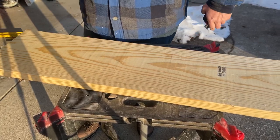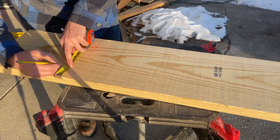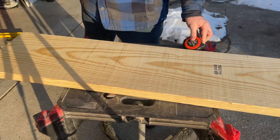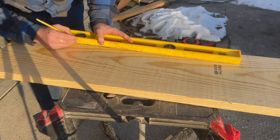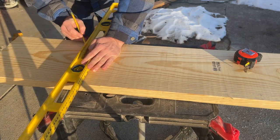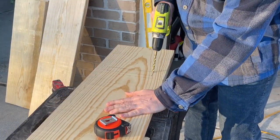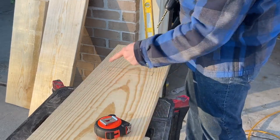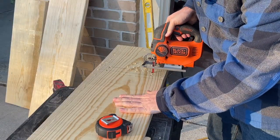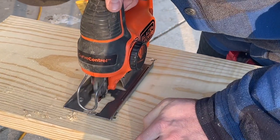We don't want it too tight a fit — if we end up too tight we're not going to be able to get it in. From each side we're going to go in two inches. I find when doing this, using round numbers makes everything a lot easier. Now that we've got that done I'm going to mark all of our spots out. I found the easiest way is to actually drill a hole in each one of the corners and use a jigsaw to cut out the hole, so that's what we're going to do. I ended up using a 5/16th drill bit, which allows for my jigsaw to fit in perfectly.